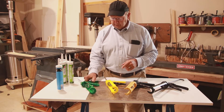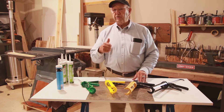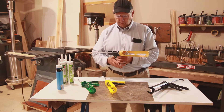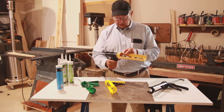So depending on the gun I'm using — if I use this one, 12 to 1, if I put one pound of pressure on the trigger I'm exerting 12 pounds on the caulking tube. And this is an 18 to 1 thrust ratio, so when I pull the trigger and put one pound of pressure on it, I've got 18 pounds here.